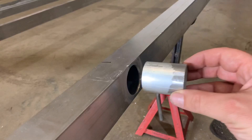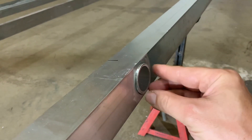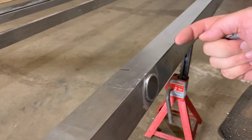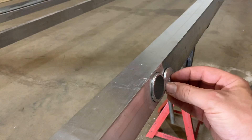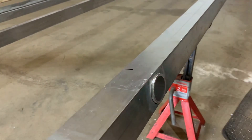The idea is that this piece of pipe is going to be inserted from the outside with a weld around the outside and a couple of spots where I drill through just to attach it on the inboard edge so that it can't twist inside the frame. The outside diameter of this pipe is almost the same as the inside diameter of the box tube, so I don't expect twisting to be an issue anyway, but just as a safety precaution. When I slide the pipe in from the outside, I've left it so that there's a little bit of a lip sticking out, because after this box tube frame is assembled there's going to be another piece of plate on the outside — about an eighth of an inch thick — and that means I'll end up with the pipe being flush with the outside so I can do a weld around it.